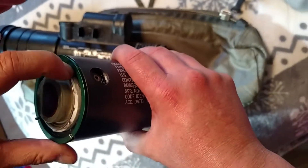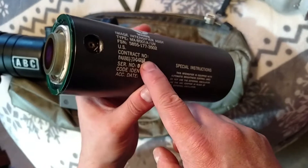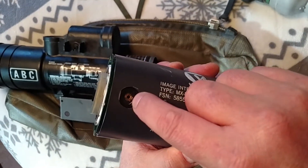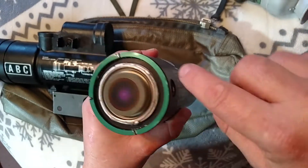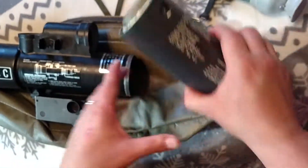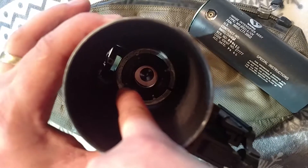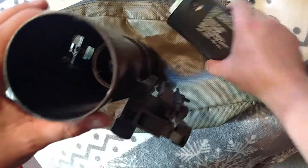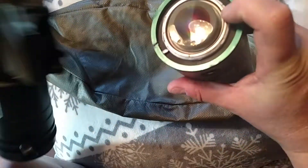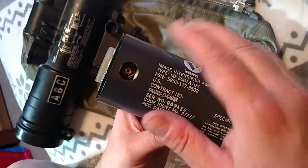This white part is a silicone mold placed around the unit to protect it and absorb shock. A lot of times when you get these surplus scopes they may not work because of two things: one, this brass ring might be dirty — you want to clean it up really well; that's where the positive goes. The negative is this ring that goes around the outer perimeter. Get a light sandpaper and clean it up well, because it contacts the housing deep down. It has four little clips that ground the image intensifier to the housing. If that is dirty and doesn't make good contact, this unit will not fire up. More times than not, it won't fire because either that ground ring or the positive lead is dirty.